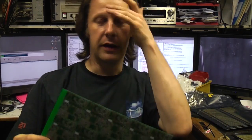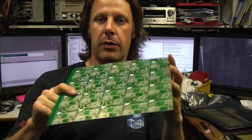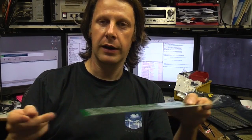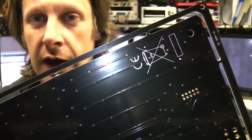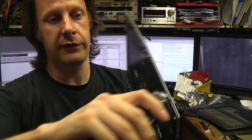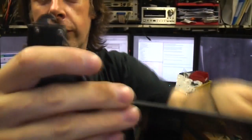When you're making any quantity of PCBs, you tend to make them up in panels to get minimum handling expense and cost, and maximum throughput on your production line. There are generally two ways of separating PCBs from the panel. One way is to use a score with tabs, which can be cut out with cutters or a de-panelling tool that pulls it out. There are also mechanical, pneumatic, and electric versions of these at high volumes.